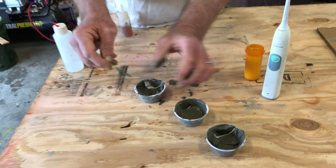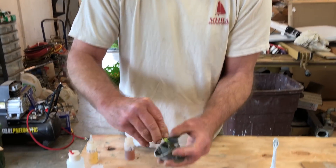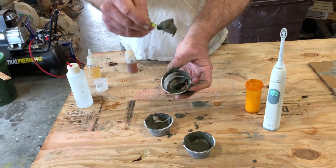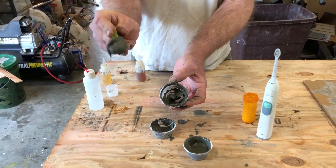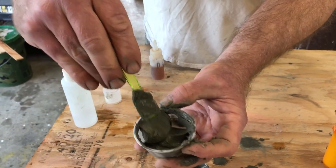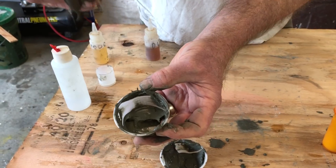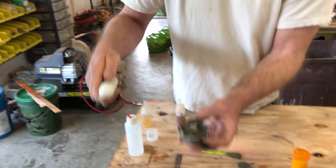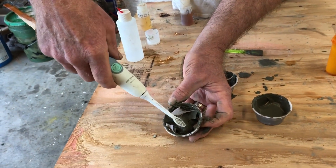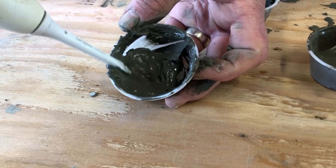That'll go away. We have a hard time using a really high dose of PCE because that self-leveling effect tends to stay with it. So here's the plain cement — you can see this has a really nice body. It's not too sticky, easy to work. And then I can show you that it has extreme shear thinning. So now we're gonna hit it with a little vibrator. You can see that just turns right back into a mud puddle.